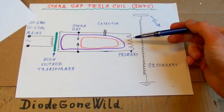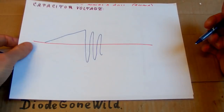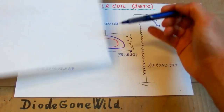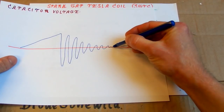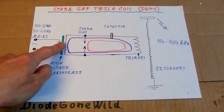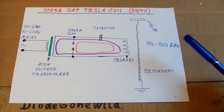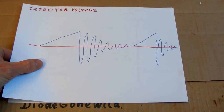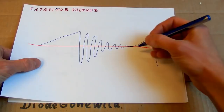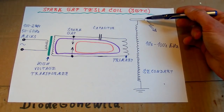Because some of the energy is getting dissipated due to losses in the circuitry and some energy is transferred into the secondary, the oscillations go down — the amplitude decreases. Then there is not enough current to sustain the arc in the spark gap, the arc disappears, the capacitor recharges and it all repeats. Remember that this transformer runs at 50 or 60 Hz, but this oscillation circuitry and high frequency transformer works at a very high frequency — usually tens or even hundreds of kilohertz. Ideally the circuitry keeps oscillating after the spark gap ignites until most of the energy is gone from the primary side, then the spark gap quenches, and during this enough energy has to be transferred into the secondary to generate a very high voltage and sparks.